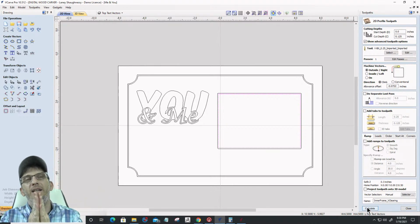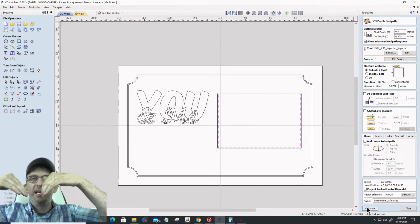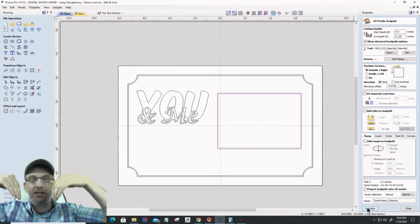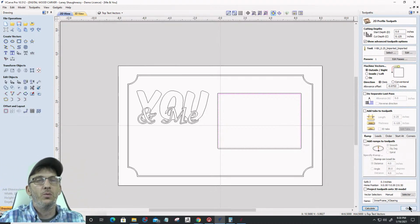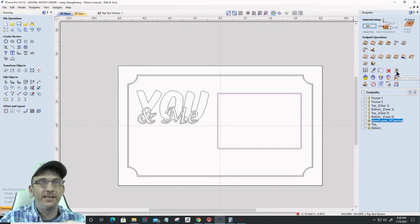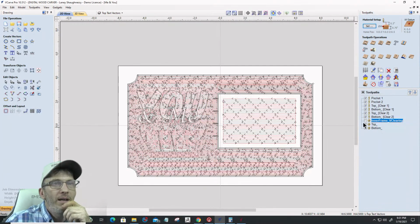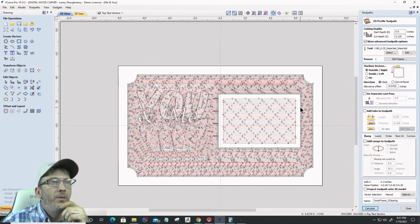That's my original. So here's where I screwed up. My original clearing, that clearing that's taking that 1/8 of an inch off, that's fine. My top text is continuing on with that from that 1/8 of an inch to create that ramp. My bottom text needs to be stepped out, or offset out, 0.0722 because it's got to continue the rest of that V down. So on that, everything is going to be fine because now when I recalculate all of these toolpaths, which one's the one screwing up still? Inner vector frame clearing. Why is that one still screwing up? Oh, it would help if I recalculated it.